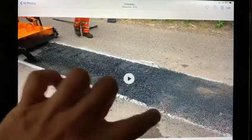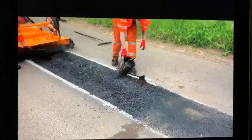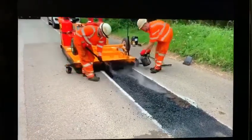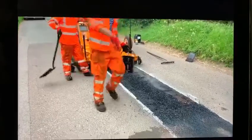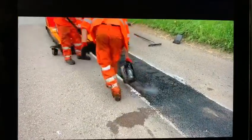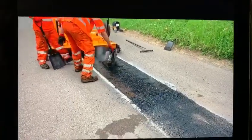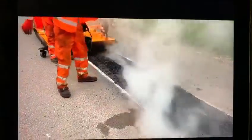You can see here we've heated the defective area down the center of the road, warmed it up, and scarified it. It's now ready for fresh bitumen to be added into the old materials. Having heated it up, it's sensible to add a reasonable amount of fresh bitumen into the old material to provide some fresh oils before it's used as a base course.